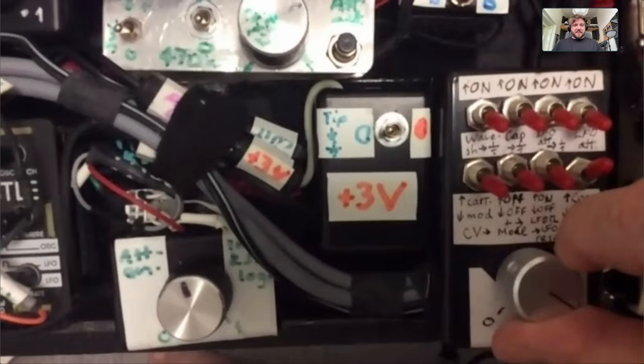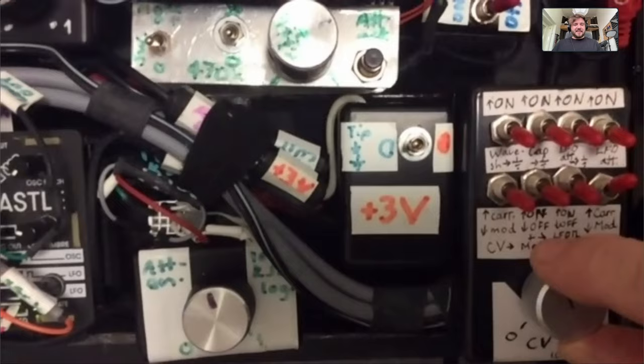So tricks like that. Now the potentiometer here, where are we? You're not seeing it, sorry. Here. It's feeding into the second oscillator. So just a control voltage going to the second oscillator so that I can change it easily without having to dive into this nest of wires. And also it means that I can find a particular tune point. That's simply amazing. I love this.